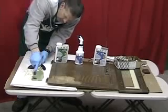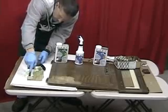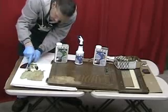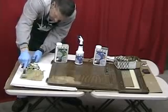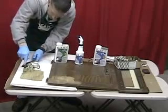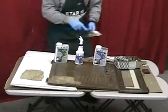Coming back to our painted door. You can see that's just pulling right off. And you want to wait until you can get all the coatings all at one time. Don't want to pull it off in 15 minutes if you know it's going to take 30. Give it the proper time that it needs. Do a little test spot before you actually scrape it all off. Make sure it's gone all the way through.